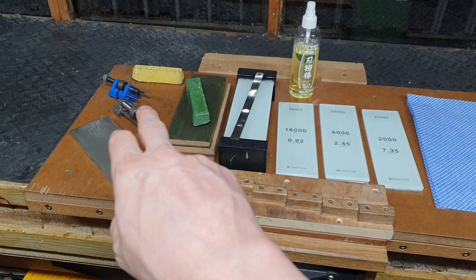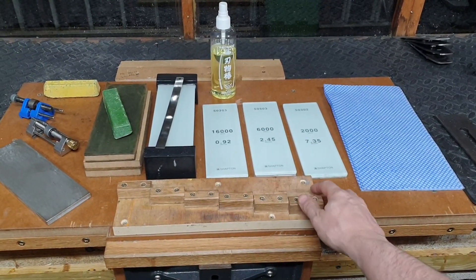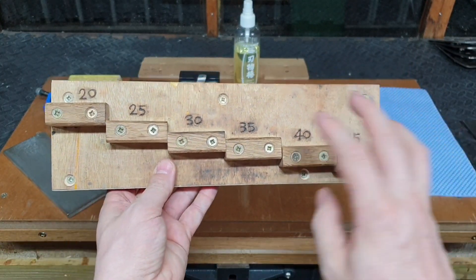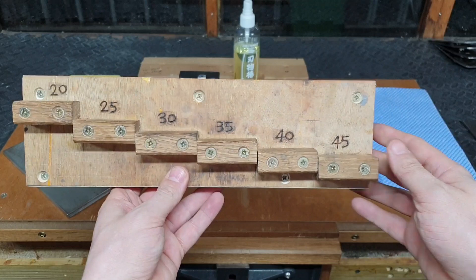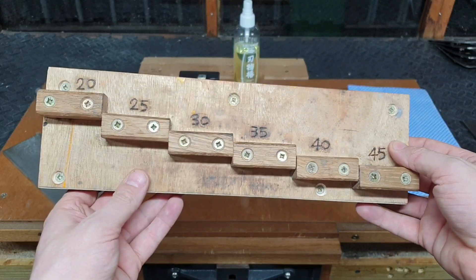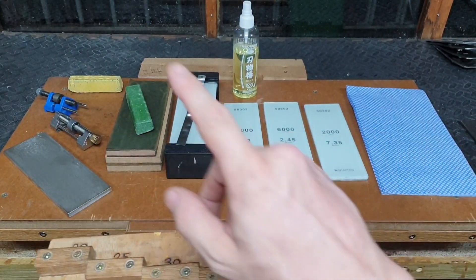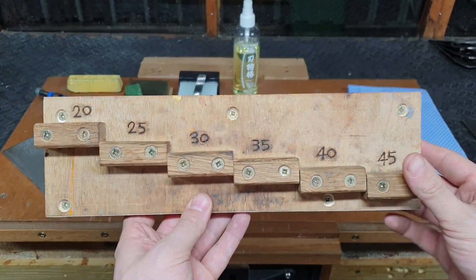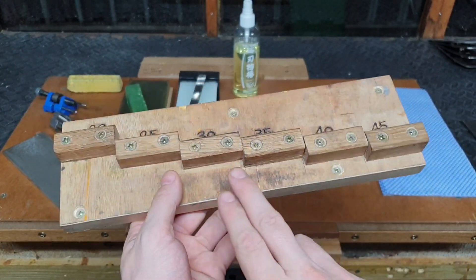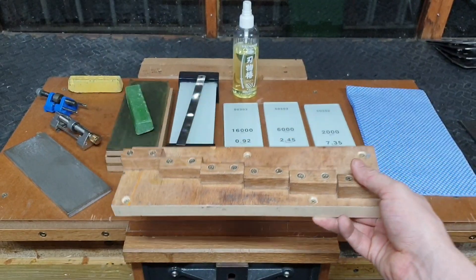We've got some various honing guides and cloths. Now the most important tool we've got is the depth stop. This depth stop is used to get the different increments between your secondary bevels on your plane blades. I would recommend if you use a honing guide, this is definitely something you should make — I'll run you through what happens when I have a blade protruding up against the stop.